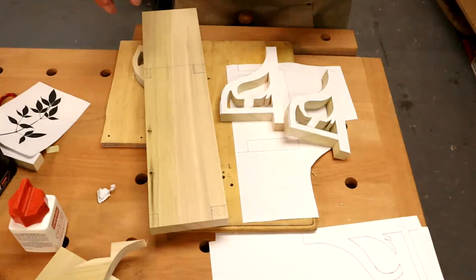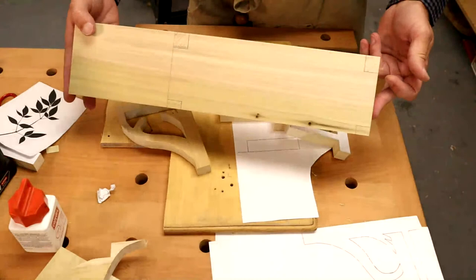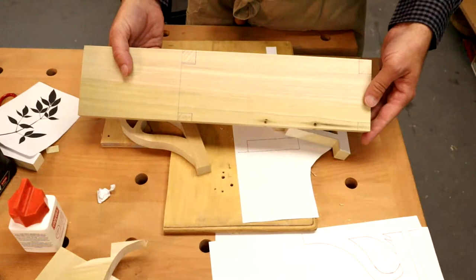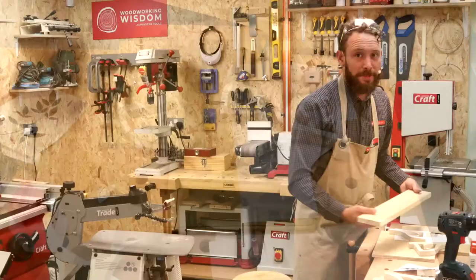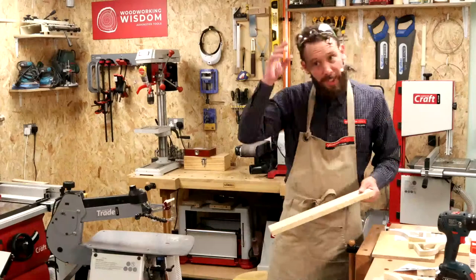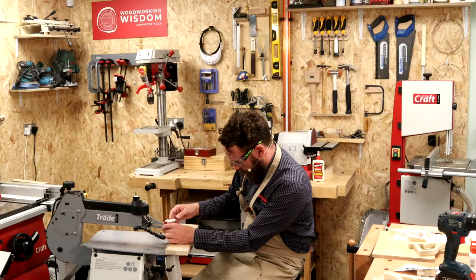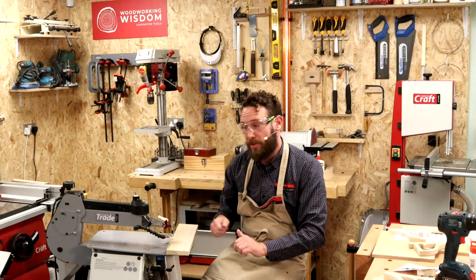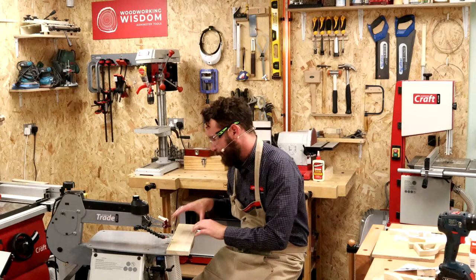So what we're doing, we're cutting out our shelf. To be honest, in here, I would probably whiz that on the bandsaw. We would probably get your lines a little bit straighter, a little bit more accuracy. But we're working on one machine today, so let's crack on with our scroll saw. We'll cut them out. But on the bandsaw, that would take seconds. But we're spoiled rotten in here, we've got all the machines. Likely at home, before I got my bandsaw, I would have just had my scroll saw. I would have done all of this definitely on the scroll saw. So, extractor's going on.